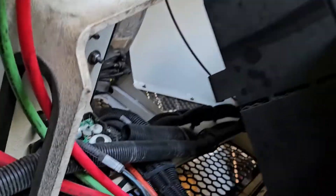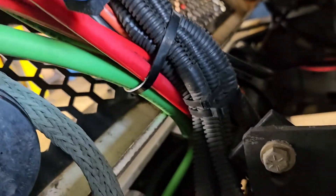If you're working with rubber airlines and you're careful not to damage them, you can pinch these off with a clamp to isolate that system. Now we need to find where that pressure on the service line is coming from, when all I did was release the spring brakes.